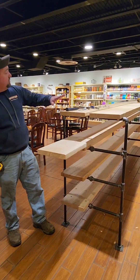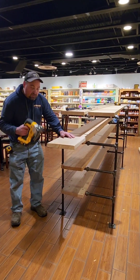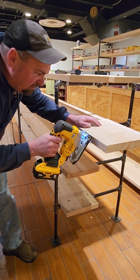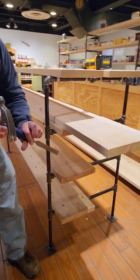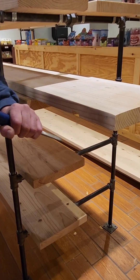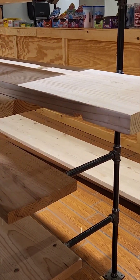So this is our frame inside here, and I've already attached a couple boards to it. We're going to attach the second layer, but because of those unions my boards are actually just a little bit too wide. So the very first thing I'm going to do is make a notch to go around that union — otherwise the board won't lay flat. I'm taking my reciprocating saw and going up there a little bit, then my handy dandy chisel right to the height I need. We're just going to knock that out. Eddie, you want to go on the far side — all the way down the far side — and that way it'll sit flat on that union.